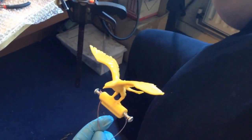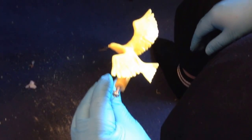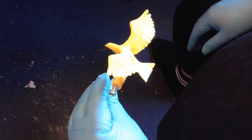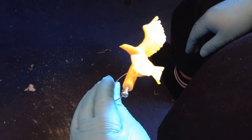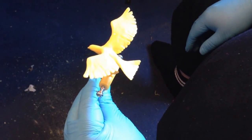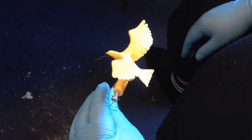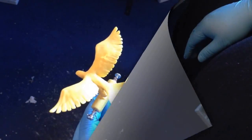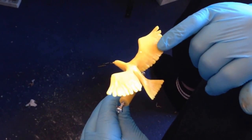Make sure the first coat is touch dry before applying the second coat of clear lacquer. We are speeding up drying time by using a hair dryer. After you apply the second coat, make sure you apply the conductive ink when the clear lacquer is just about to touch dry. If you apply the ink when the lacquer is completely dry, the ink will not stick to the lacquer.